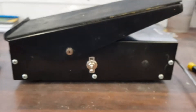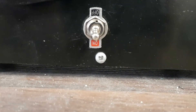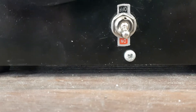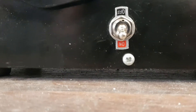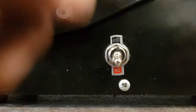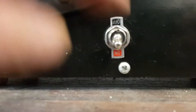It's back together with the switching. Unfortunately the legend's upside down — I can't alter it because it's got a little pip in here, and without filing it off I couldn't have turned that round. It must be American style, because I think the Americans have switches always up for on. But I wanted this down for on, simply because I'm going to turn it off to do my current regulation, and then switch it back on. I wanted it down for on just in case my foot ever slips off or anything and I knock it — I didn't want the switch to be up for on. That's my logic.